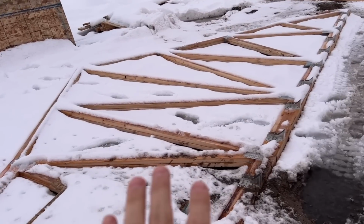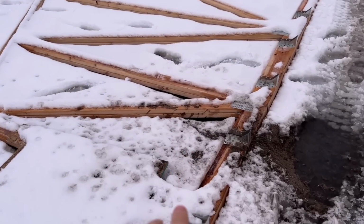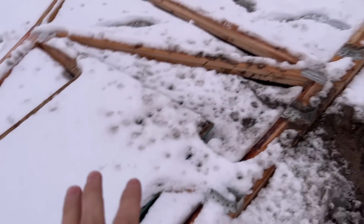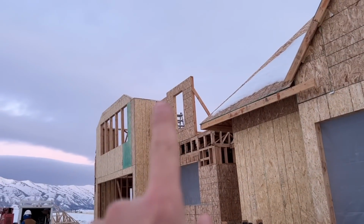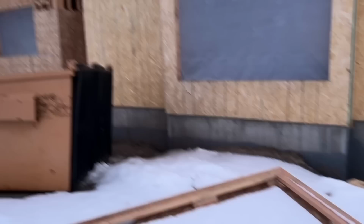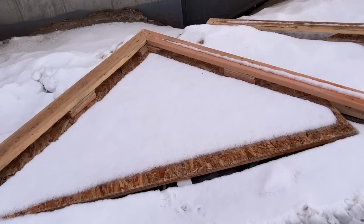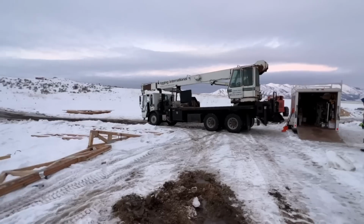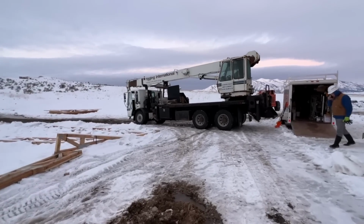Just like before, all of our framers have set all of these trusses as much as they can. They've got all of the hangers set, all of the markings laid out. They've gone upstairs and laid out on top of there where the trusses actually need to sit. These gables are built. Those are already sheeted. The eaves are on. I mean, all the groundwork has been done so that when they're up in the air, they're not spending much time there, because every second this guy's on the job, he's costing money.